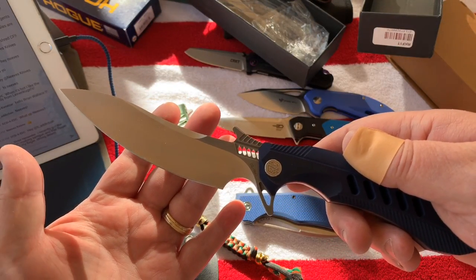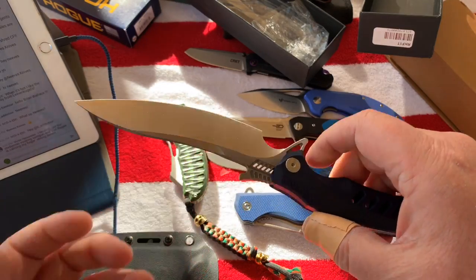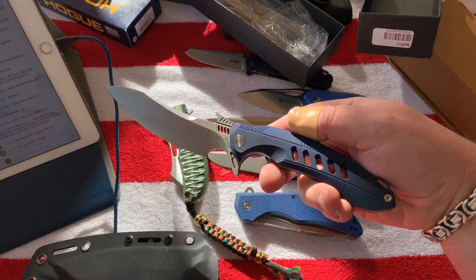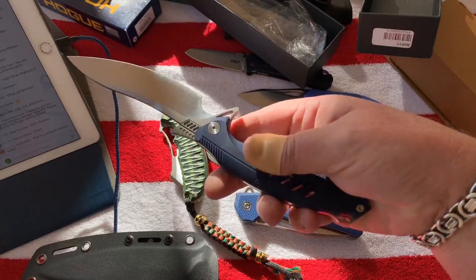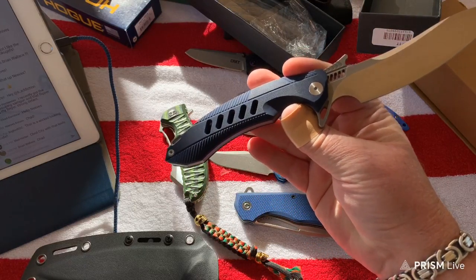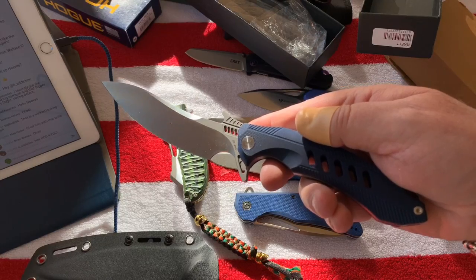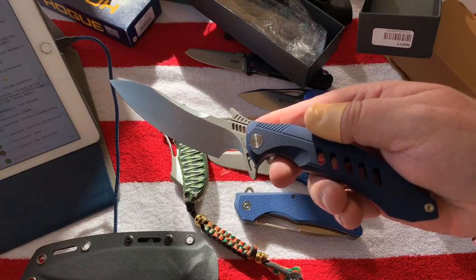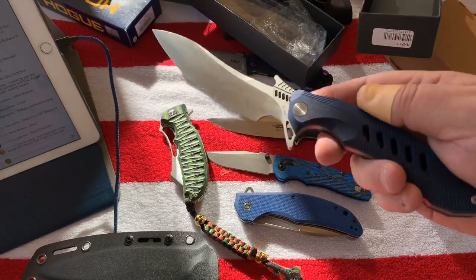It cut over 200 feet of rope which is good because this is CPM D2. The blade handle looks blue - I got it brown but it went a darker blue than I wanted. Standard Chinese D2 runs about 100 feet working edge on their cardboard medium, up to maybe 110-120, and this went over 200. It almost doubled what standard Chinese D2 does - the vanadium levels being variable in D2 and the heat treat being a little more tricky.